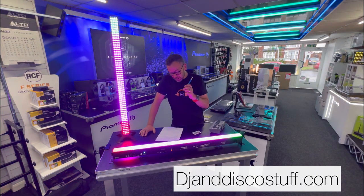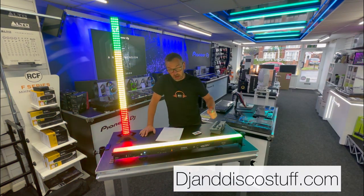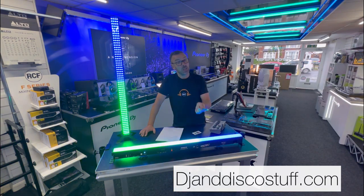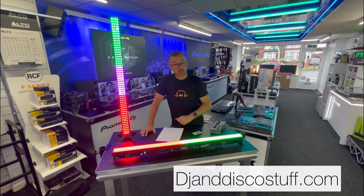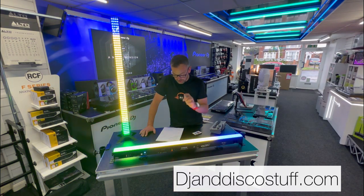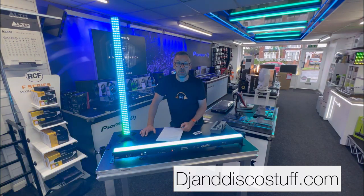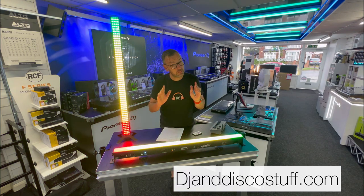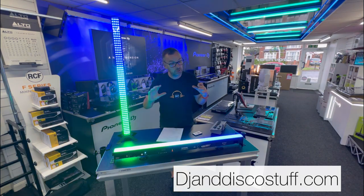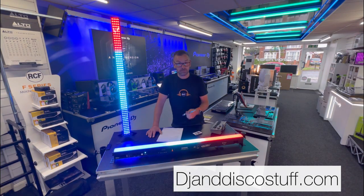For those sticking around for the full version: this item has 224 tri-colored SMD 5050 LEDs - RGB red, green, blue - producing all these wonderful colours. It's got a viewing angle of 120 degrees. DMX channels - and the DMX guys are going to love this - 3, 5, 24, 48, and 53 channels of DMX. I've seen some amazing videos of the Spectra Pix Baton being programmed on DMX desks, and you're going to have that same control wirelessly.